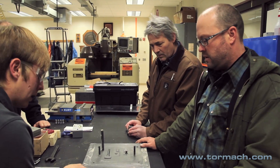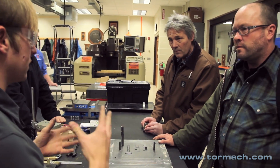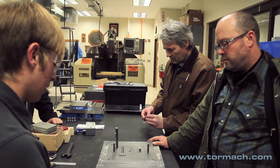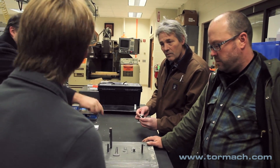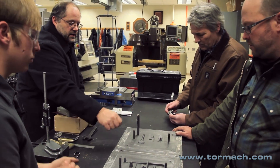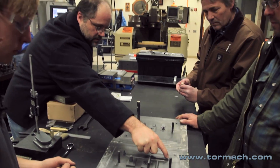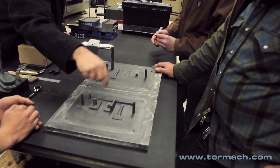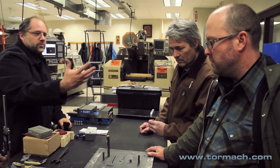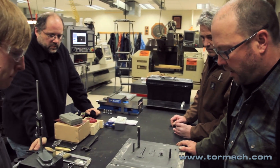These here would be the gates where the metal flows through, and then this is the runner. It's hard to visualize — you'll get a lot better visualization once you look at the sand mold itself; you can kind of compare apples to apples. So the material would technically go down this — this is the sprue. That's where the metal goes down to begin with, and then it comes in here, and as it flows through, it'll go through these gates into these parts. But you're looking at a bottom at the top, so it's hard to put it all together, but I kind of get it.